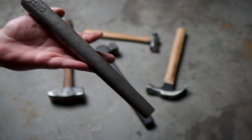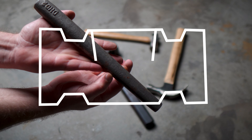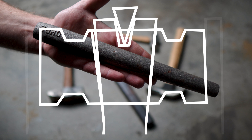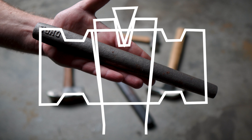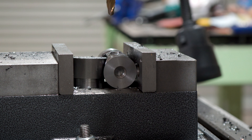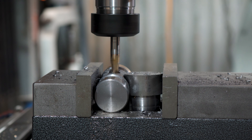Now to give the eye a little taper. When you forge a hammer, you would use a drift to give the hole a little taper. The hole tapers from larger at the top to smaller at the bottom. The top of the handle is cut to the same size as the smaller hole in the bottom, and then a little slit for a wedge is cut into the top of the handle. You drive a little angled wedge into the slot, forcing the top of the handle out to meet the taper in the hole, locking the whole thing together. I'm thinking around 5-ish degrees should get me enough taper to make the head lock down, but not so much that I can't get the wood to spread far enough without breaking. Using a digital angle finder and a precision shim to set the angle, I'll finish out each end of the slot until the taper is almost all the way to the bottom of the hammerhead.